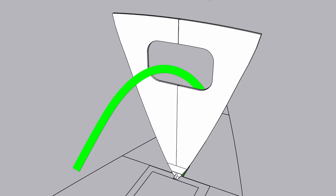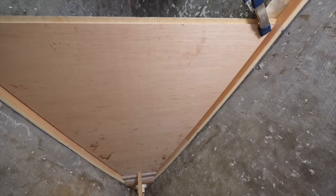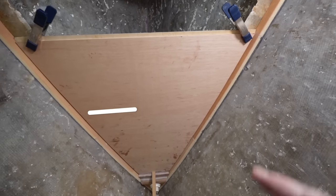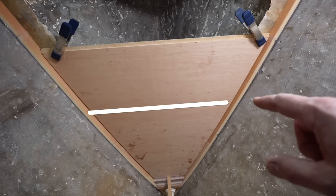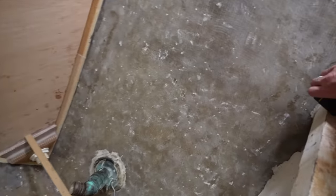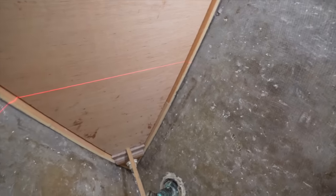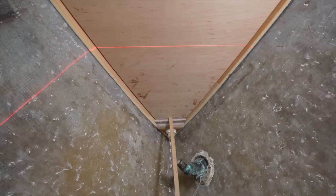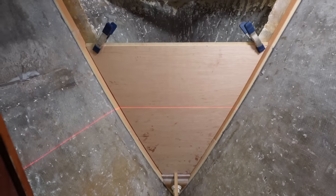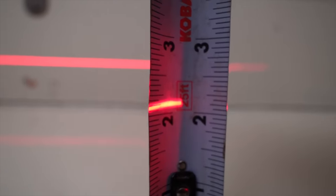It's going to be very difficult to get down into this area to bolt anything up. I want to double up the bulkhead on this side as well, up to where the platform will go. That's something I didn't think about before, but it's not too late to add it now. I have here my trusty level laser, so we'll shoot a line around the perimeter here to pick up where the brace will mount on the bulkhead, and I'll finish grafting in the extra little piece. I just need to remember that that line is 2 1/8 of an inch above the bottom of the brace.